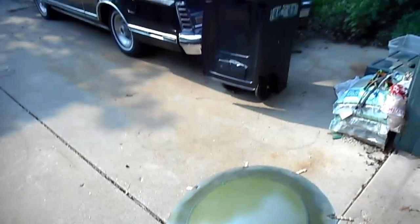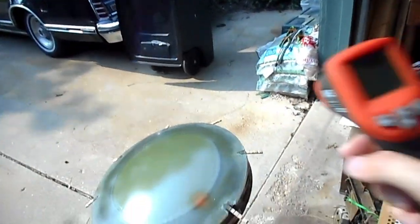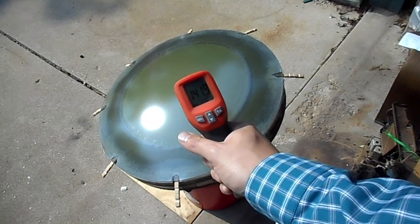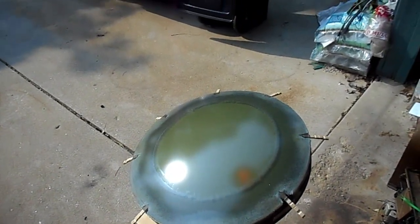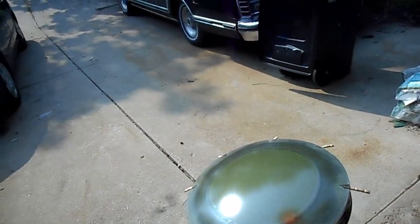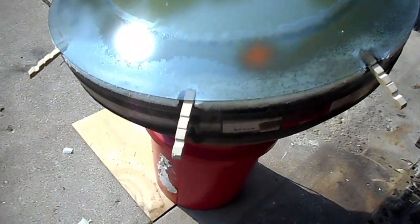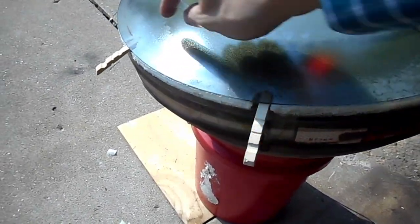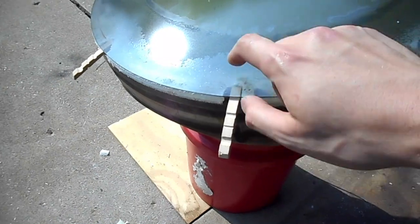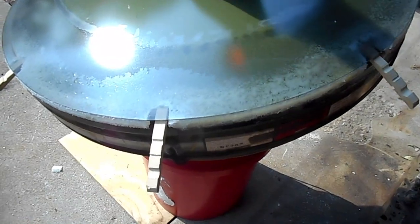And I'm going to work on the CRT. We got ourselves a heat lamp going on it. And we have about 145 degree temperature on it, give or take in various places, between the heat lamp and the warm Wisconsin sun. So we're gonna hit this thing with a heat gun. I think you can see the delamination going on. We're gonna see if we can get all that delamination evenly and uniformly pushed in from the edges to the center.